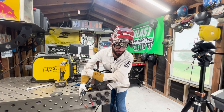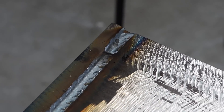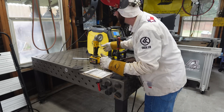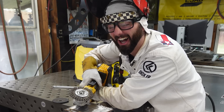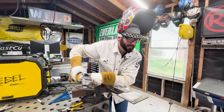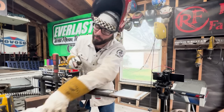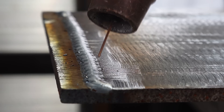I made a little start and stop there — if you can't see, it's okay to stop, just go ahead and make that tie-in. Now that we've got our first weld on there, it looks okay — it will get us done. The important thing is that we have the same height, the same width, and the same weld size all the way across the plate. Before we continue, I highly recommend taking one of these wire wheels — I call them a jimmy wheel — and giving the weld a quick clean with a little back and forth to keep things clean as you move forward. Mr. Wiz, you weren't doing that.